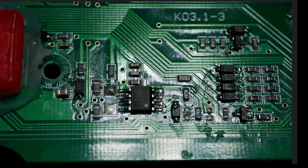Lots of repair work done on this board. Lots and lots of repair work right here. And this is all input circuitry right here. These are probably TVSs is my guess, in other words, protection components. But yeah, lots of repair work right here in the input section. This board suffered some severe catastrophic harm, okay? And they had to do a lot of repair to get it working again. Let us move on because there is gobs more to see.